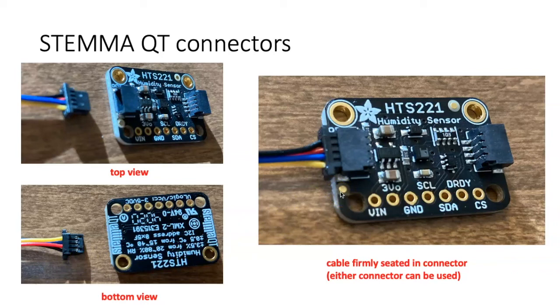When you press the connector in, push it in as far as it'll go until it's firmly seated. It's typically seated well enough that it won't just fall out. If you want to disconnect, grab the connector by the two ends and pull and wiggle a little bit — usually it will come out without too much trouble. It doesn't matter which of the two connectors on a sensor board you use. The second one is there if you want to chain an additional sensor into the I-squared-C network.